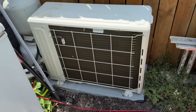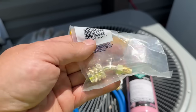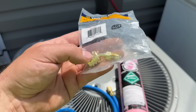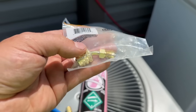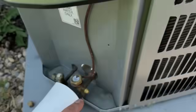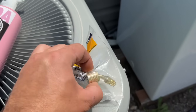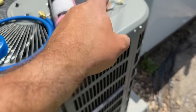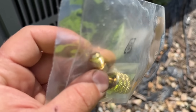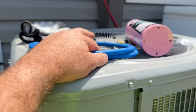If you're working on a mini split, you're going to have one port — only one spot to charge your refrigerant — and you'll more than likely need an adapter. This one is for A2L refrigerant and goes from left-hand threads to regular hose threads. Your mini split is going to be 5/16 inch instead of the standard quarter-inch size, so this adapter goes from 5/16 to quarter inch. The end of this has a core depressor, so when you thread it on, it pushes the depressor in. If you have a normal system, it's typically going to be quarter inch.